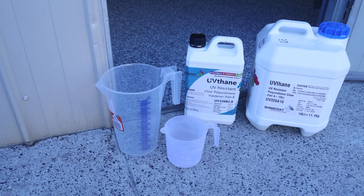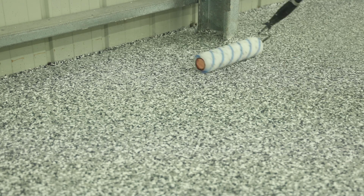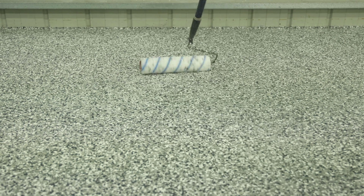Now the top coat can be mixed and applied with a roller. It's tricky to see what you have and haven't completed here, so work in long strokes to make sure you're getting complete coverage. Once completed, you can leave it dry for 24 hours and then walk on it, waiting a few days before any weight is applied and a few weeks before putting a car on it.